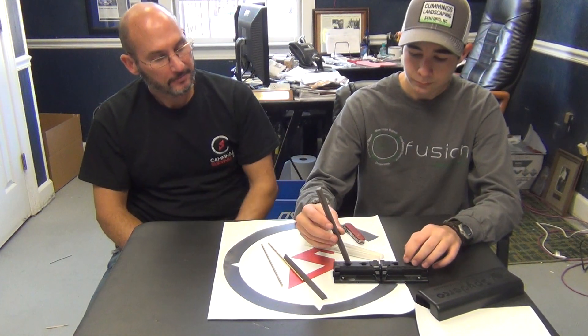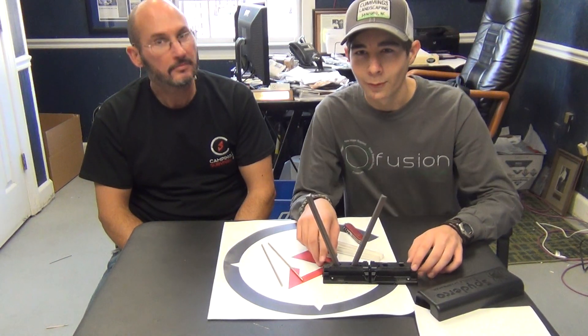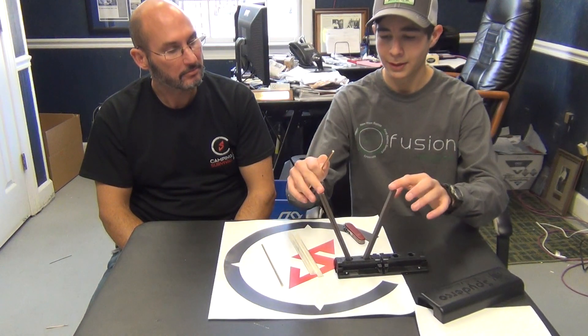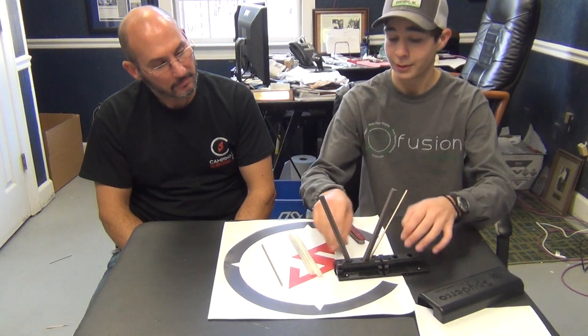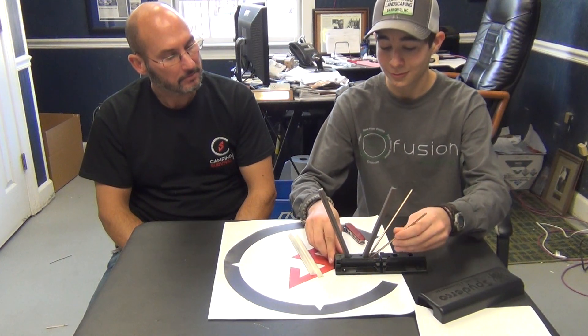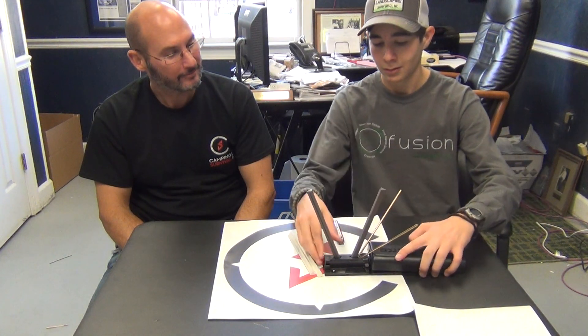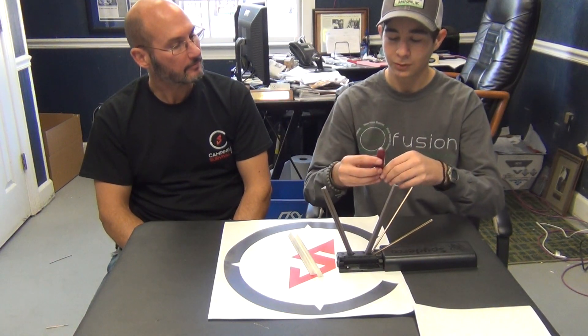For EDC purposes, I'll go ahead and start off with the medium stones. I prefer to have this on the flats. You set it up on the 40-degree angle, then you set your brass safety rods in here - I've never really used these, but they recommend it so you don't cut your fingers. You stick this piece right here and put it like that. Today I'm going to be using a Swiss Army - I believe this is a Spartan - but its blade is fairly dull.